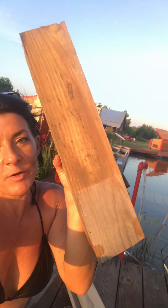Okay, so what I did was, we have some extra wood and I'm repurposing it, and these are solid wood planks, but they're about 3/4 of an inch thick, and they were about 7.5 inches wide. I'm using the table saw to cut them down to the sizes that I need. And because we've got the 4x4 on the bottom, I need some strength up on the top. So we've got other 4x4 cutoffs from another project, and I'm using those at the top.